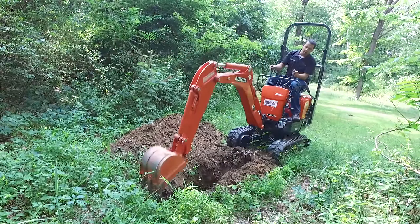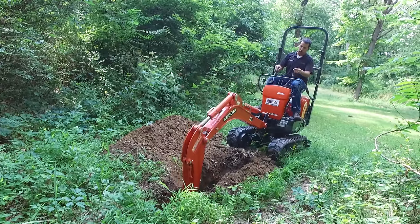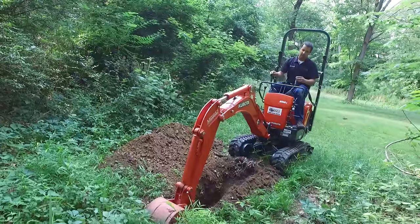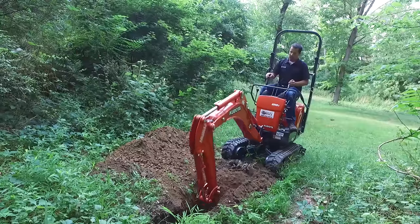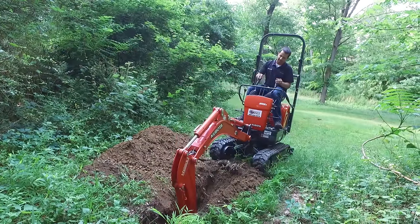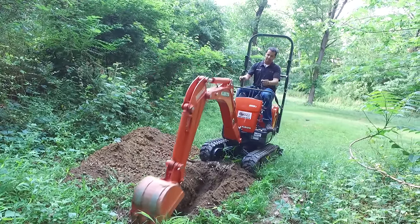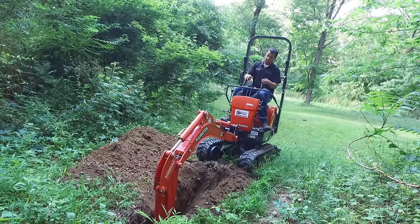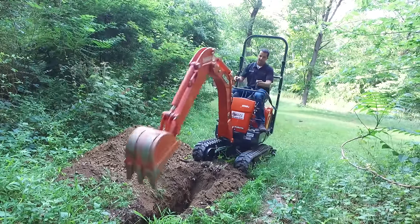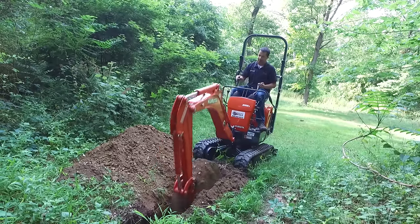You can see I'm comfortably below the frost line now. If I was out trenching for electric, putting in pipes for a pool, or doing landscaping work with bushes and that kind of stuff, it's a great machine for that — easy to get around and productive enough to work with. It has its limitations like any machine; it's not a full-size excavator. But its capacities, weight, and productivity make it a popular choice for a lot of applications. While you don't sell as many of these as full-size excavators — their sales are quite a lot lower than say a 10,000 to 12,000-pound machine — they definitely have their niche. If you watch trailers around here, it's not infrequent to see somebody pulling one of these to go do some jobs.